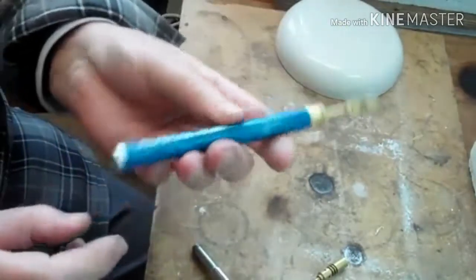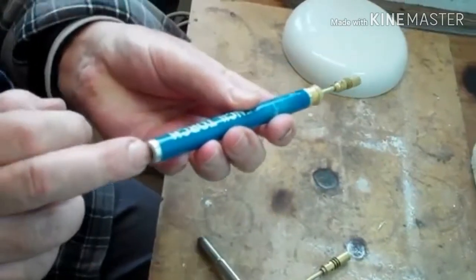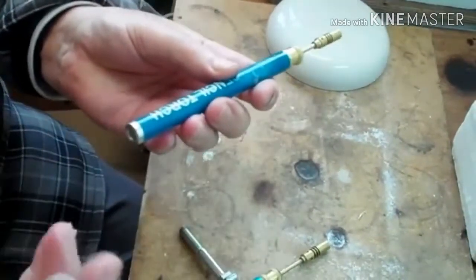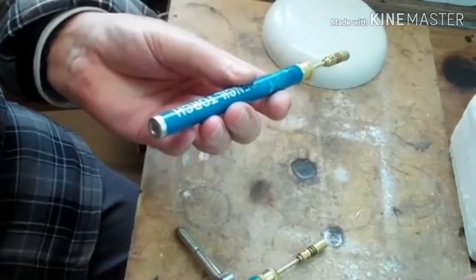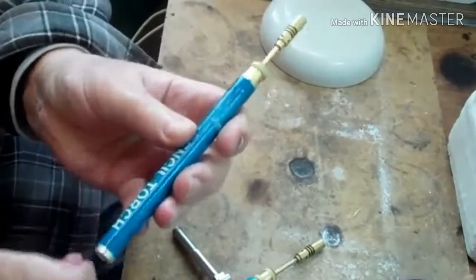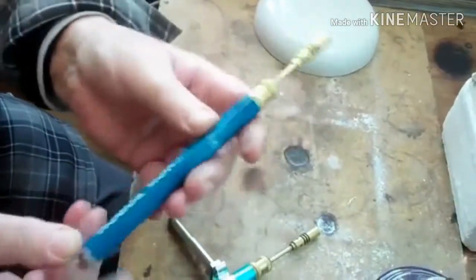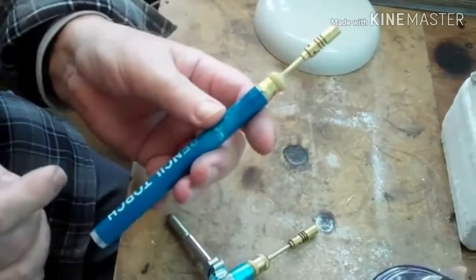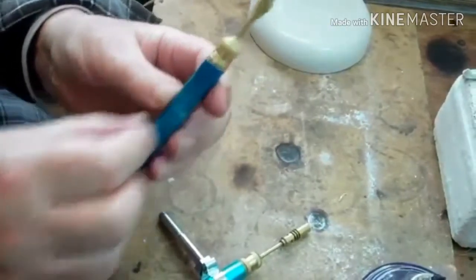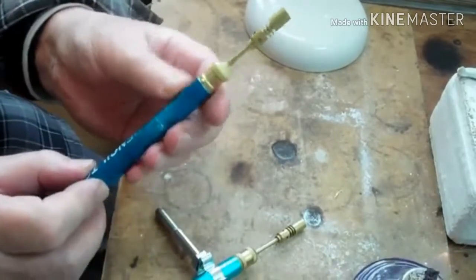Until you realise this, you think either the one-way valve has gone wrong and you start playing with that, or you're looking at the adapter bit from your lighter refill canister and you think the problem is here. In my experience, it isn't. It's in a blocked jet. So we know how to clear the jet. What we need to do as a secondary improvement is to make the fuel tank remote from the torch.